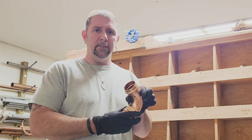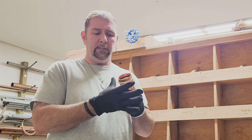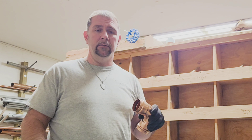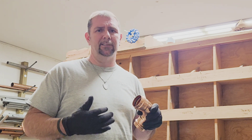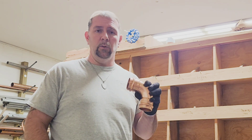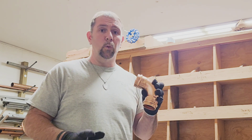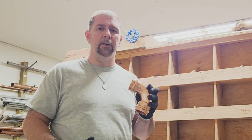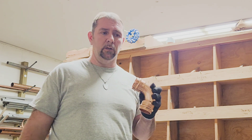With the ProPress, it's basically your copper fittings and you squeeze down on the edge over the outside ring. It's really nice — sort of like Pex crimping except it's copper squeeze, and they call it ProPress. You can get it from a quarter inch up to four inch. The kit that we have goes from a half inch up to two inch, but you can buy extra jaws that go with it.